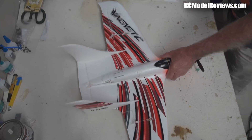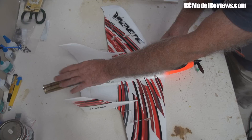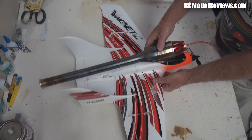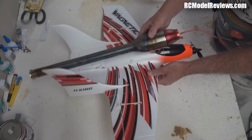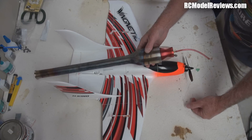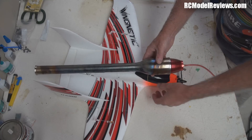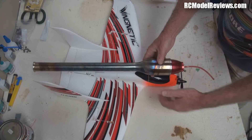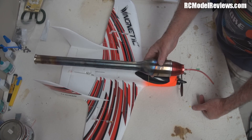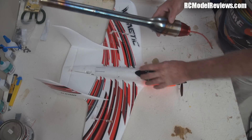One of the key factors for a good pulse jet airframe is twin tails, so that the tailpipe of the pulse jet isn't going to set fire to the tail of the model. I thought this might fit quite well, but on reflection it was a little bit too big. Also the CG would have been an issue - if I put the engine up front, the fuel tank has to be way forward of the CG, so as fuel is used it becomes tail heavy. Pulse jets also use a lot of fuel and there's not much space.